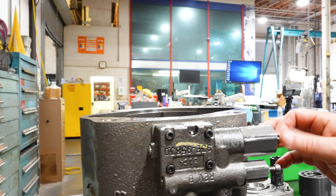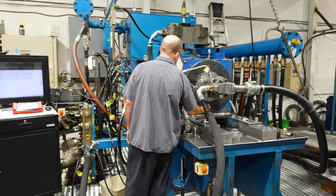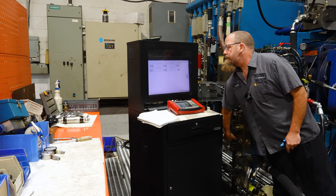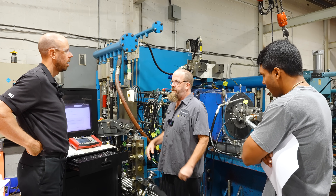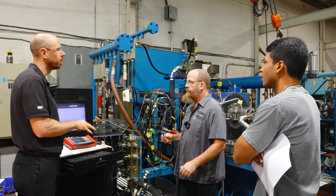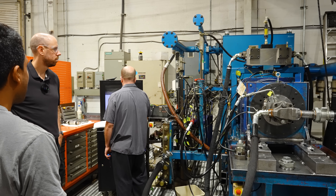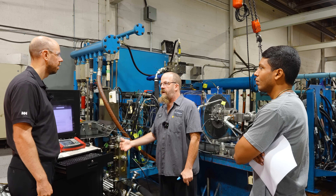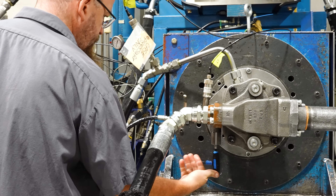It was that loose compensator screw. Looks like they didn't tighten it with a lock nut, and the rattling of the mobile equipment would have rattled it loose. They did the right thing by pulling the unit off and getting it inspected before any serious failure could damage other components. Having the compensator backed all the way out and loose would cause no pressure — which was their complaint — and that's what it did on the bench. It was the pressure max, not the differential. The differential was not touched, just the pressure max.